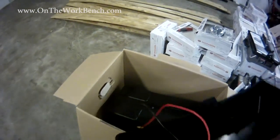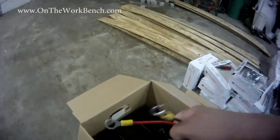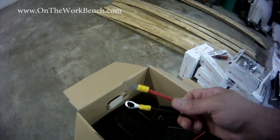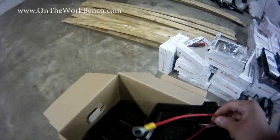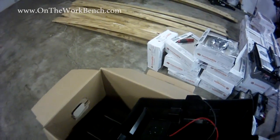And the actual battery pump connection is here as well. This housing should keep your battery all nice and dry, and you can see the connections that go into the battery. This requires a marine battery or a deep cycle battery that you can run all the way down. They come in a variety of forms, but they are 12 volt. You can run it with the battery clamps for the post, depending upon the battery you've got.